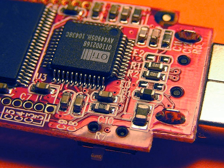Dark gray color indicates a capacitance in the μF range, generally 0.5 to 50 microfarads, or the device may be an inductor and the dark gray is the color of the ferrite bead. An inductor will measure a low resistance to a multimeter on the resistance range, whereas a capacitor, out of the circuit, will measure a near-infinite resistance.